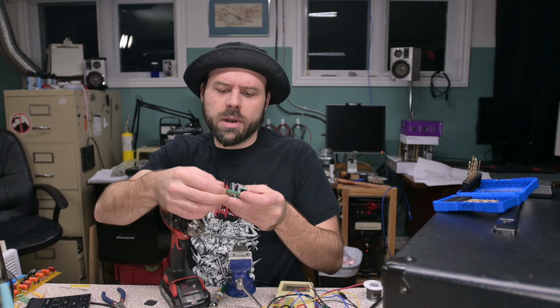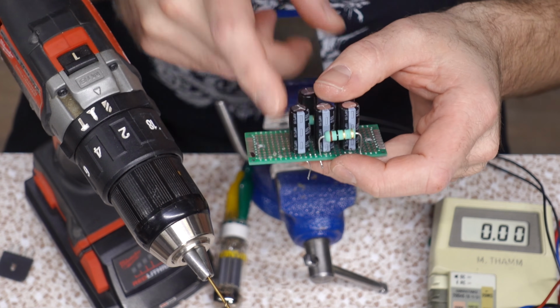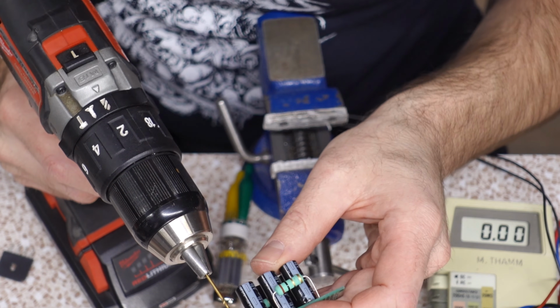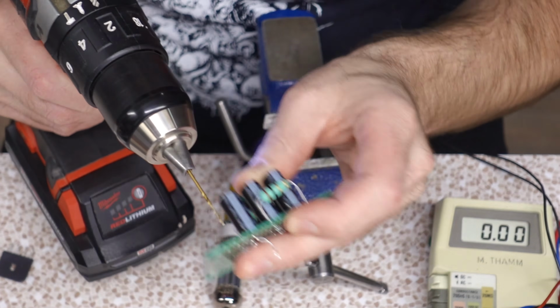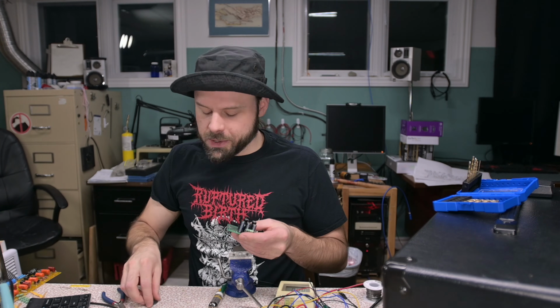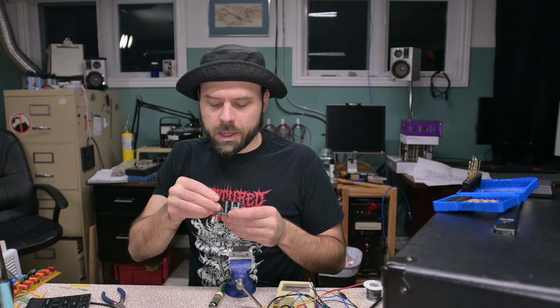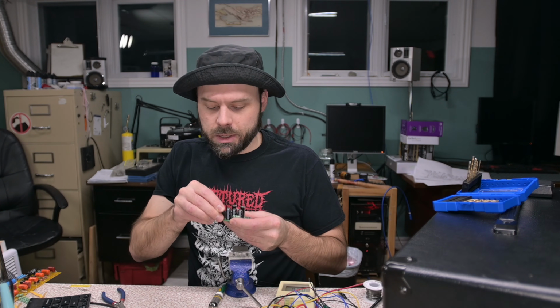Probably be quieter, whatever. However, that dinky voltage bridge has to go. I've pulled it out. I gotta drill holes bigger for the bigger bridge. It was just getting too hot, and it was starting to heat up the capacitor next to it. Surely it's not hitting anywhere near 105C. I bought high quality capacitors, but still, bud, still.